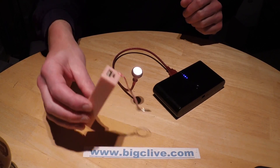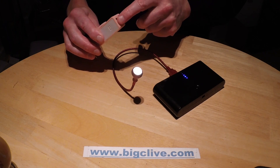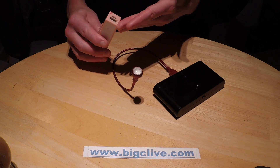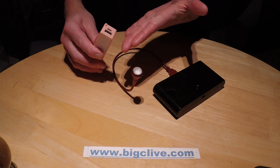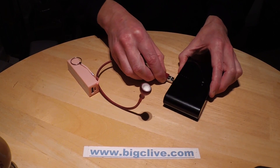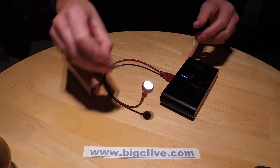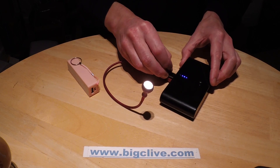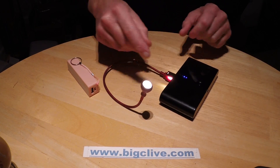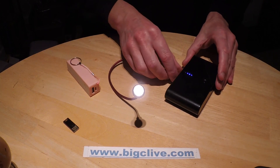Rather disappointingly, unlike these really dumb battery chargers that just put out 5 volts constantly and as soon as they detect a load they power it continuously, this one detects too light a load and it goes out. I've found that if you plug it in and it just displays the battery status, that's going to cut out. If you plug in enough of a load, like this little USB light, and it starts counting down, then it'll keep it on. But it means that for use as an emergency light, it's not going to work, because it's going to go out after a while.